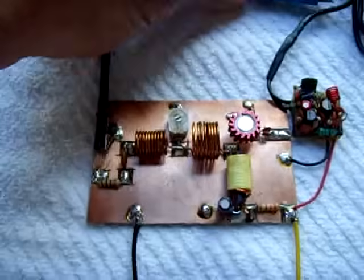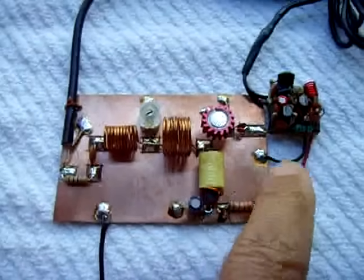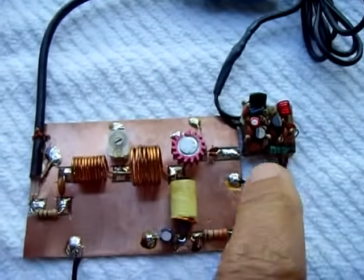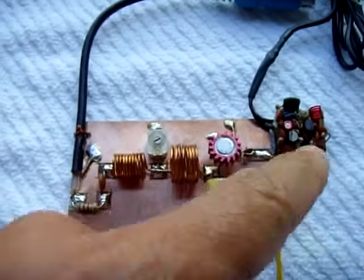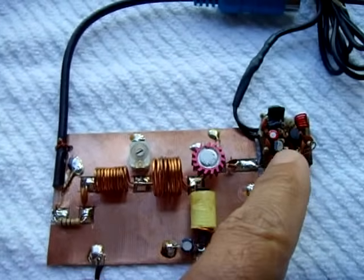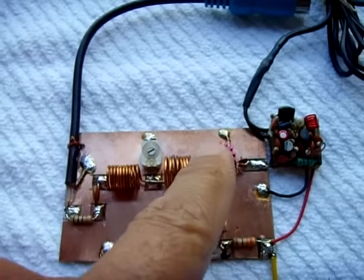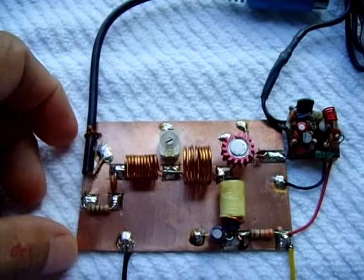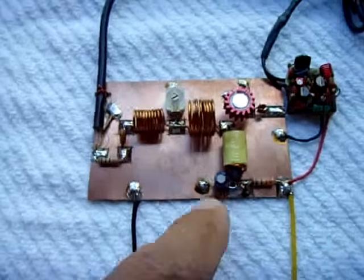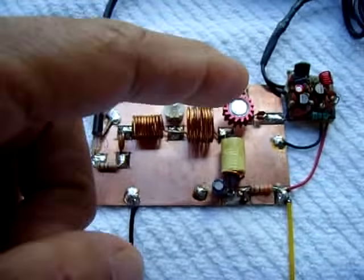I just tried this out last night using this little tiny transmitter together with this amplifier. The whole circuit draws about 100 milliamps total — this one draws about 28 mA and the other draws about 70 to 75 mA. I was getting well over a mile range with no problem with this little setup, and crystal clear audio.